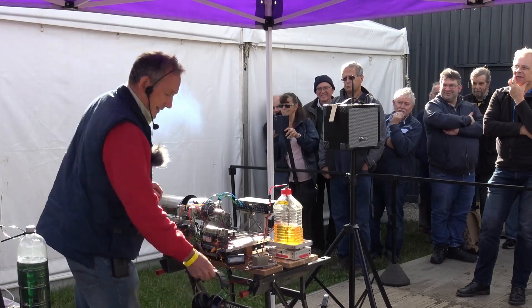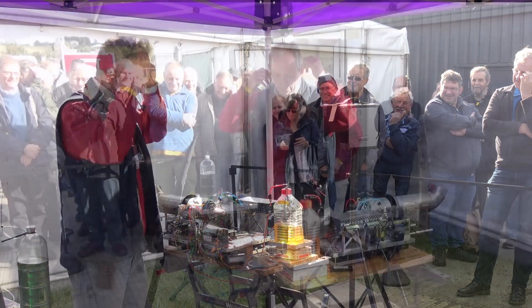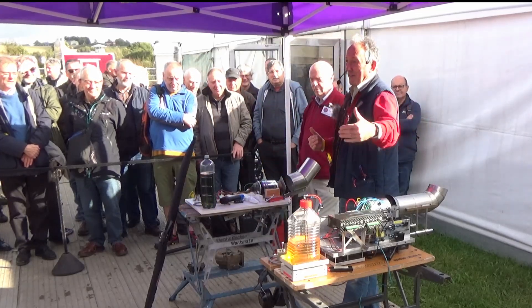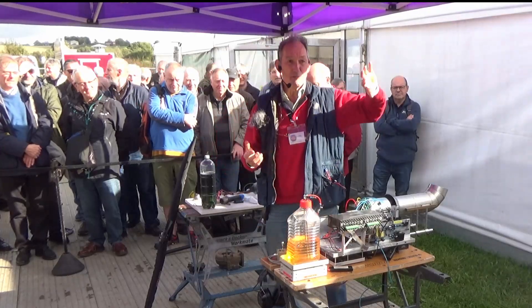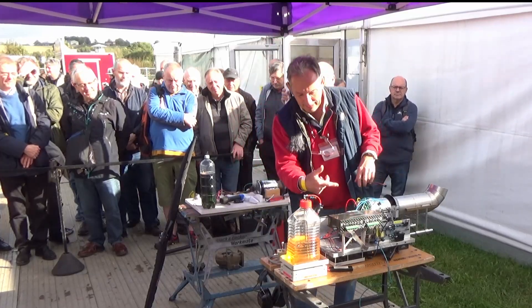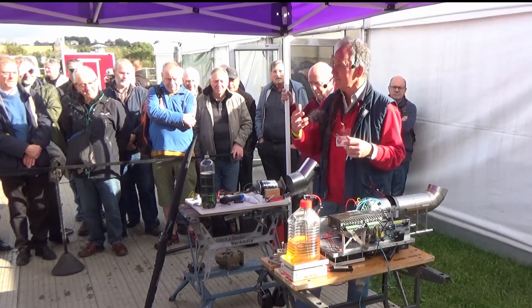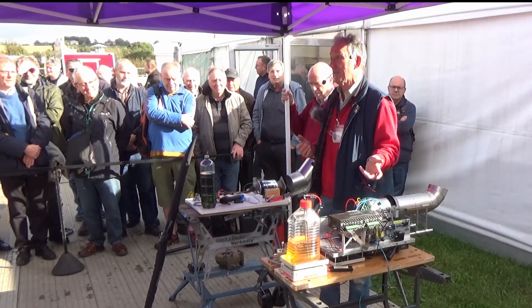And that's basically all it does. As I was saying, the five cubic feet of air per second going in there — and the thrust, that is just the remaining fuel after it's shut down, just in the manifold system, that's burned off. The starter motor has now dropped back in again and is actually just pulling cold air through, because the only way to stop the jet engine is to turn the fuel off. There's no ignition as such, so you can't turn the ignition off. It has stopped the fuel flow.